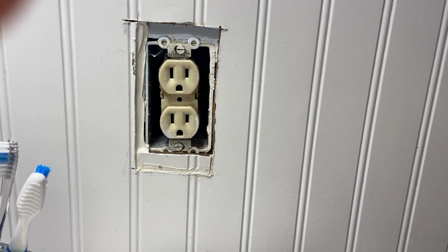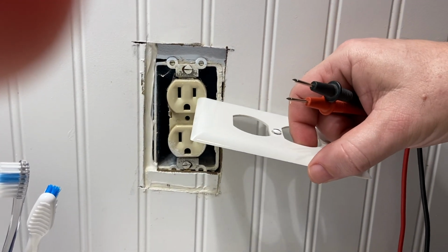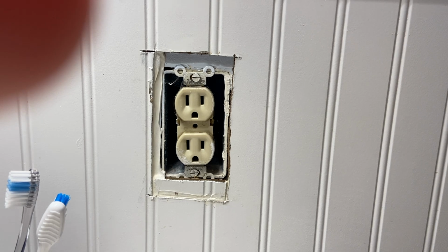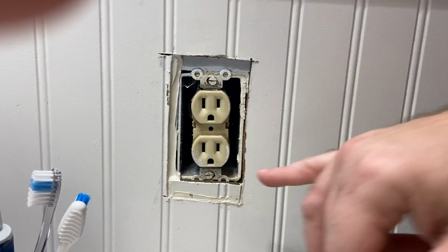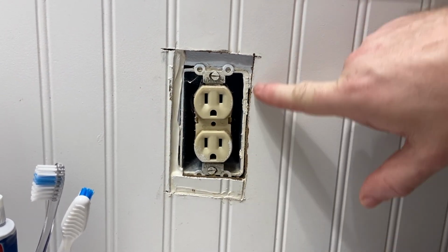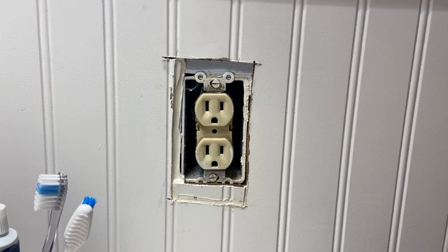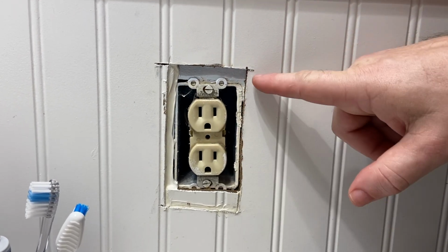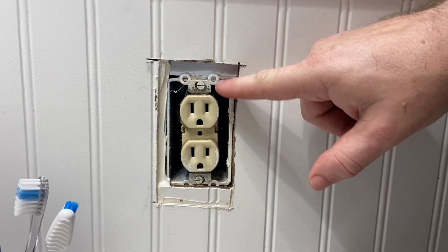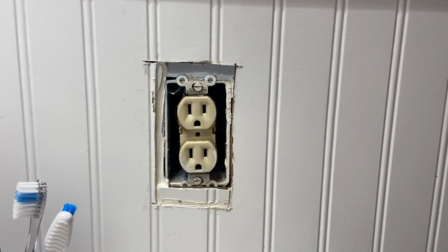All right, to fix this correctly, because they replaced the plates but left the receptacle the wrong color, we'll have to see if I have a white receptacle, otherwise we won't be able to fix it today. But definitely we have to move it out, and I guess here I'll have to put something to bring it out that dimension, just a little bit so it will not look sunk in. The top and bottom are more important than left and right, because where the receptacle sits is bottom and top. If you are a little big here, that is okay. It is not a catastrophic failure.